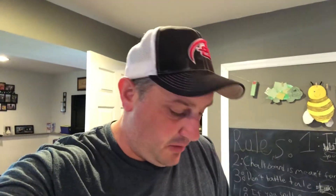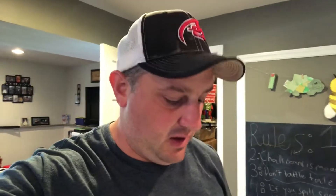Hey, welcome back to Average Mike. Today I have a leak in the basement sprinkler lines that the installer did a couple years back — maybe eight years or so. The PVC pipes they installed started leaking at the 90-degree fitting behind my shower in the basement. I can't get access to the glue spots, so I'm going to cut the pipe prior to getting back there and put a shark bite fitting on.